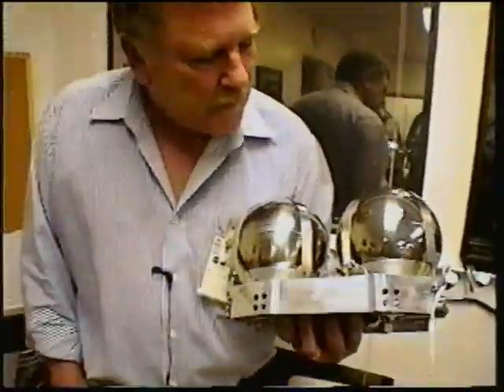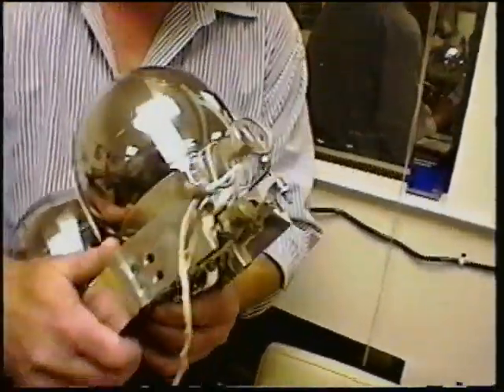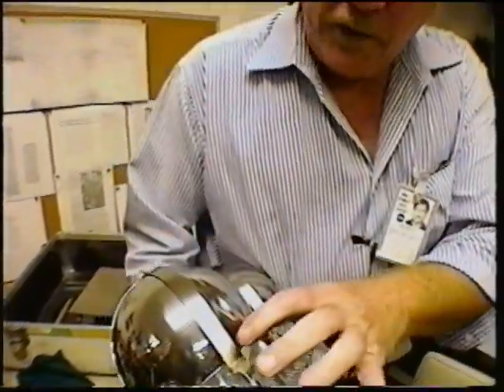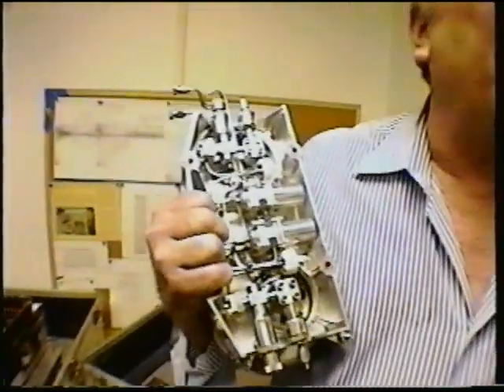The regulators we got from a company that did aerospace stuff — his name escapes me now, but that was kind of neat. The straps were set up — oh, there's a little rust in here too. That's supposed to be 300 series stainless, and it's surprising that it rusts — usually that'd be 400 series that does that. But this allows it to go into expansion; there's 20 mils of Viton under here. I scratched my first son's name into this right here. His name's Kevin, and I wanted him to orbit the solar system forever, so he got a name scratched in there — very lightly so it'd get past JPL.